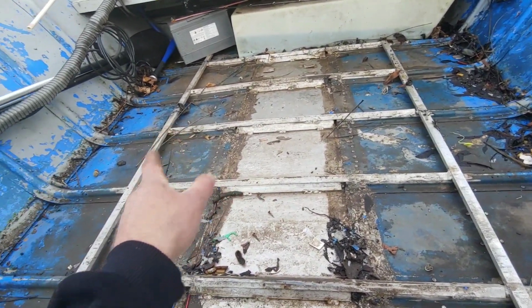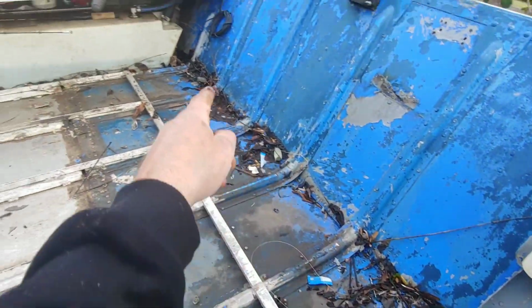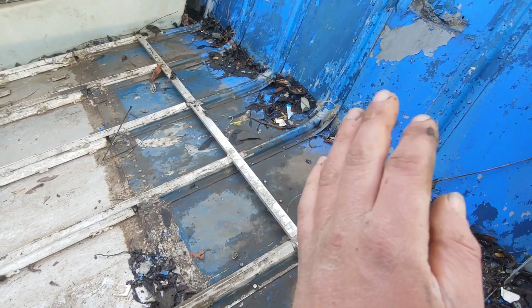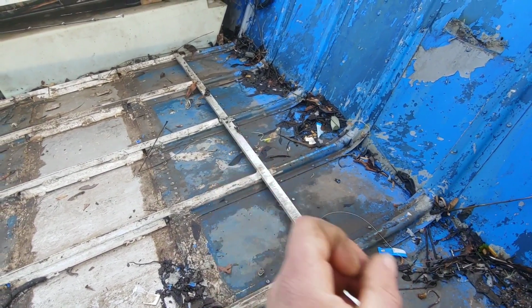And you see these voids? These voids here. That is where water was intended to pass through by the manufacturer to get to the back of the boat. I plan to maintain that, but not entirely. I'm not gonna go on purpose to make that sealed up, but if it happens, it happens. But if I could avoid it being sealed up, I'm not gonna worry about it. That way water can still pass around the foam.